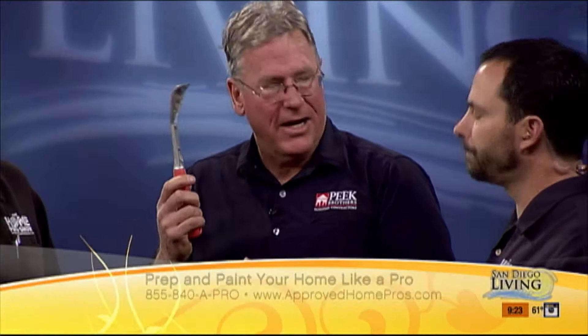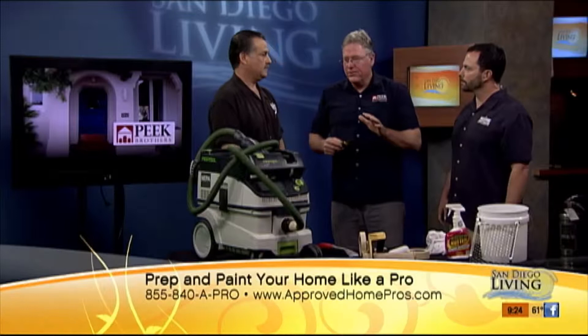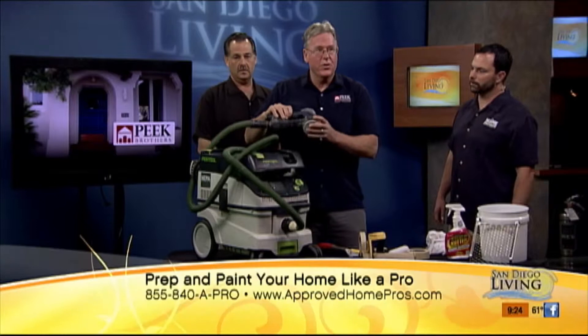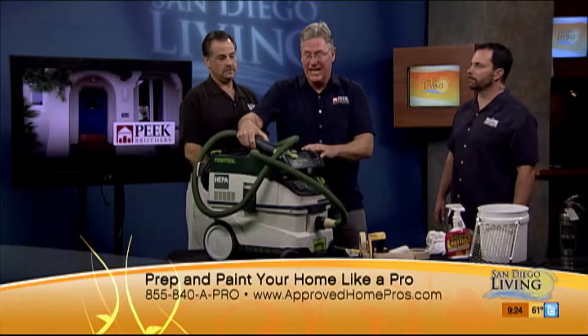John, you do all kinds of painting — residential, simple houses to historical, commercial. Prep is key. The first thing to do is get the mildew and dirt off the house with a water blaster. So many of those old structures have lead on them, so it's very important that when you're doing your sanding, professionals use a vacuum cleaner with a HEPA filter — this is called a Festool sander. Every time you turn it on, the vacuum turns on while you're sanding, keeping the environment clean while giving you a good prepared surface.